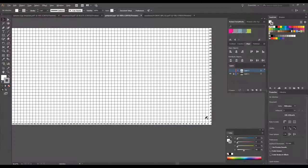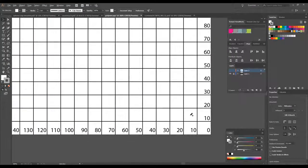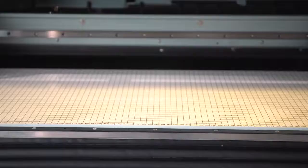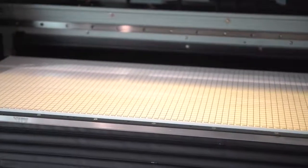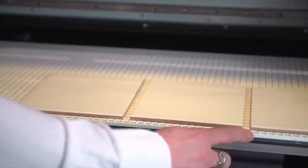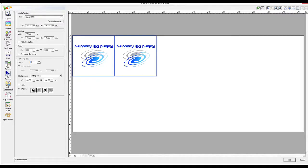For printing multiples of square or rectangular items, you could print a grid onto the bed with incremental steps and place the items onto the bed measuring where they are on the axes. All you need to do is create a file the same size as the printable area of the device with incremental measurements and print it out at full size. In this example we have printed measurements along the X and Y axes in 10 millimeter steps. You can then align your items, note where they sit on the X and Y axes, and use VersaWorks to move the nested items to match their locations on the bed.